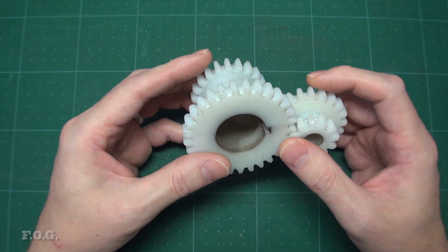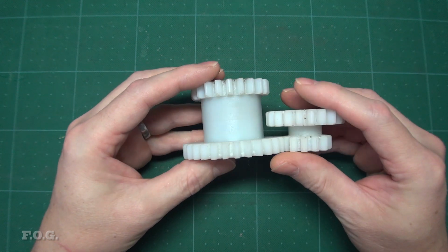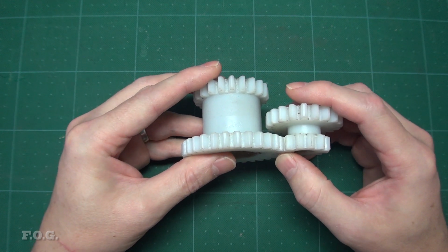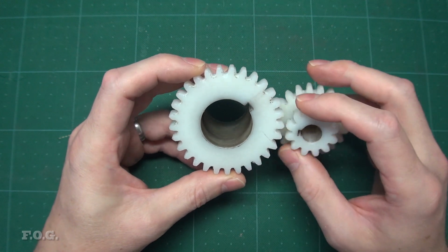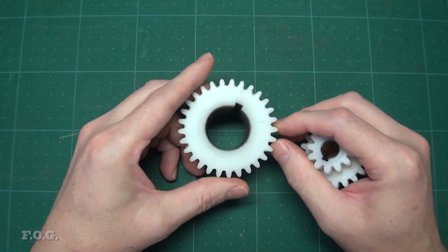So to sum it up, I can confirm that the metal gears have gotten rid of the weird galloping vibration, but the metal gears do make a more annoying metallic sound compared to the plastic gears, with the high gear specifically noisier, likely due to the misshaped gear teeth. I guess the noise is not really that surprising. I mean, they are large teeth metal gears with no active lubrication.